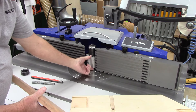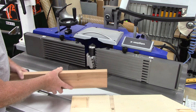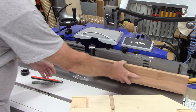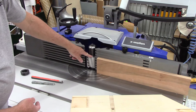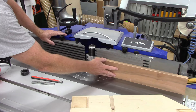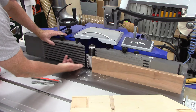This cutter is 81 millimeters. I've got nominally 100 millimeter stock that I need to feed through it and make a big groove through the flag case side pieces. I've got 10 millimeters between the table and the bottom of that spur, and then I've got 81 millimeters, so that takes it to 91. I don't have a whole lot of meat here, and I wanted to talk about things as I cut this through. If I didn't do anything else I'd really have issues at the bottom because there's a fairly large gap here.